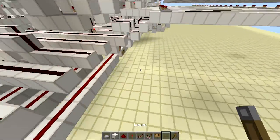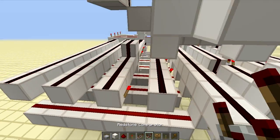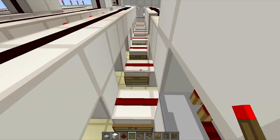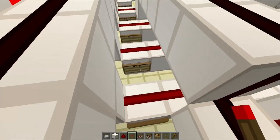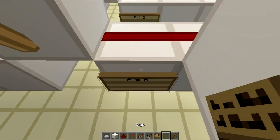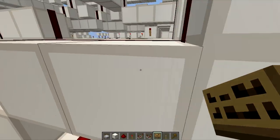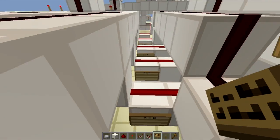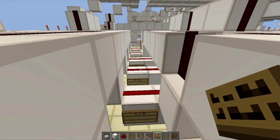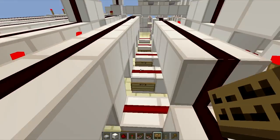So this is basically what, hopefully you saw, what I did for testing whether these things were correct. Let's just look at how these are made. If 0 is obviously just going to be if 0. If carry out, it's just going to be carry out. Now we're on to the proper ones that need a lot of stuff. To do these functions, all three have to be on subtraction mode, or invert B, anyway, subtraction is the easiest way. With subtraction, you can get all these three and two extra, so you can have 5 different things. You can have if greater than or equal to, so that adds an extra 2. But basically for that you need subtraction mode.